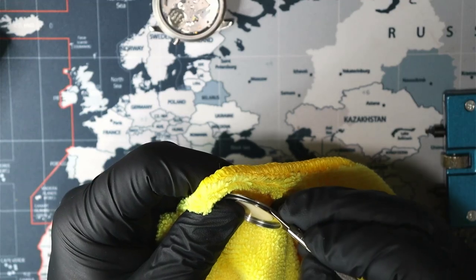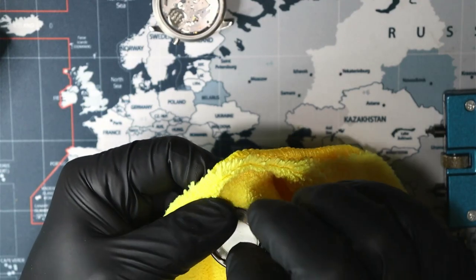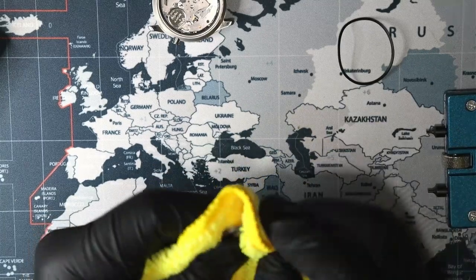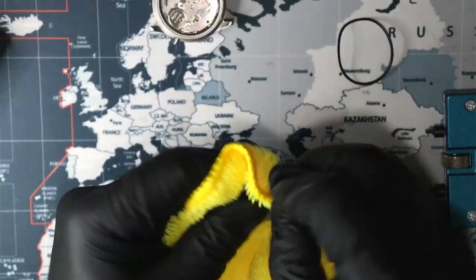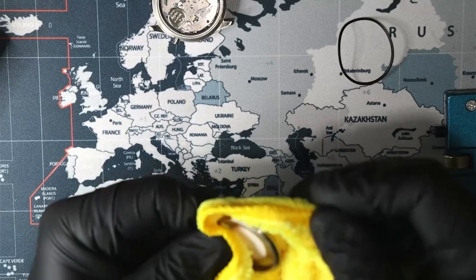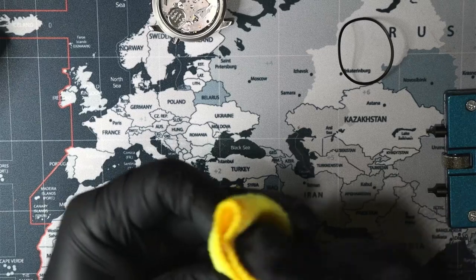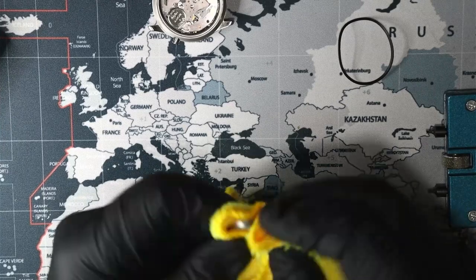We don't want to pinch it, we don't want to damage it. Oh here we go — oh yeah, there is grime in the groove. Let's take the gasket out. Put a little bit of lens cleaning solution on it. This is the closest to proper that I can find. None of the cleaners that I use in my garage are applicable for watch cleaning for sure. I just want to make sure we're not shoving gravel into the watch movement, even though it's a quartz movement and a lot of those things are hidden. I know that a quartz movement can also be lubricated, that there are pivot points that need some lubrication — I will research that a little more.